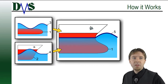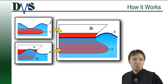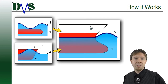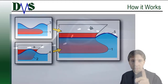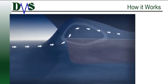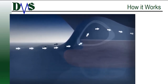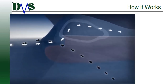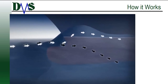The key is what happens when we put a small bulb in front of a big ship bow. The ship bow generates large waves — that's a bad thing. If we can reduce or cancel those waves, we can recover some of the power that is lost to generating those waves. Enter the small bulb. Place a bulb in front of the main bow, and it also generates its own wave system. That's good. By careful engineering, we can arrange things so that the trough of the bulb's wave aligns with the crest of the main bow wave, and this partially cancels out the main bow wave and recovers some of our lost energy. Pretty neat!